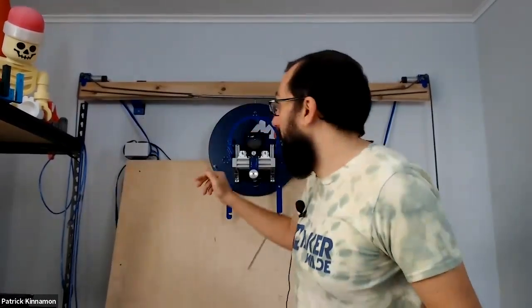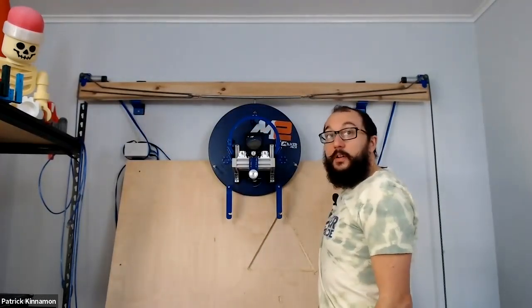That's what I'm guessing. There are a couple of things to check. The first thing is making sure all of your measurements are exact on your top beam. Especially this right here, this has to be level. Those measurements have to be exact so that when the chains are pulling back and forth, it's not at a weird angle or slant. So that's the first, just making sure your frame is all set. The next thing is making sure your wasteboard isn't bowed.